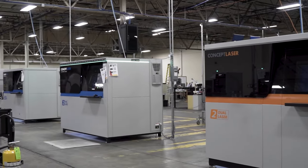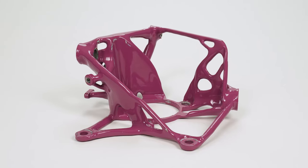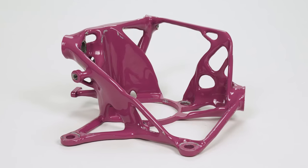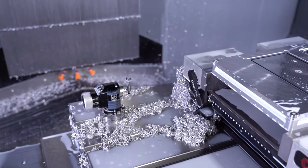Laser powder bed fusion has a lot of great benefits. It helps you get to a near-net-shaped metal part much more quickly than a forging or casting, because you don't need any tooling. It has significant design benefits: it's compatible with assembly consolidation — taking parts that might have been assembled from multiple pieces and printing them as one. It's also great for generative design and topology optimization, creating lightweight, efficient shapes with minimal material. Less waste is another benefit compared to machining a bracket from a block of material. There are also material advantages — titanium, for example, is challenging to machine but relatively manageable to 3D print using laser powder bed fusion.